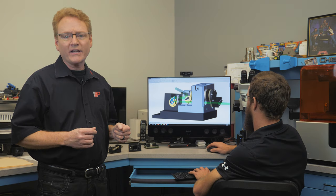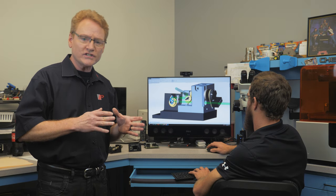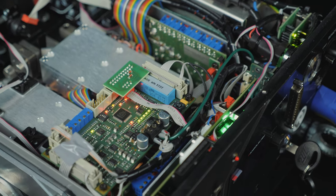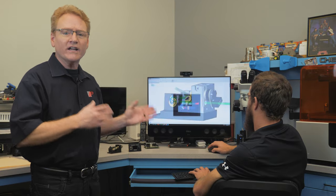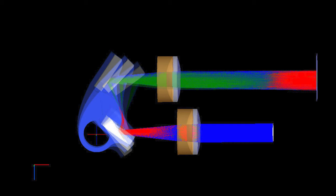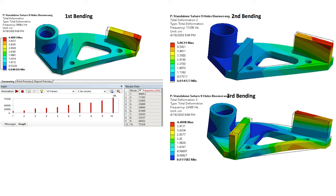For critical applications including audience scanning, the beam divergence can be monitored using the scanner's position sensor, which can be fed into PASS to provide an additional layer of safety. Now this may look like a simple system, but there were many technical challenges to overcome by way of detailed computer analysis. First, the boomerang needed to be made light enough to allow rapid motions, but also stiff enough to prevent the mirrors from resonating and flopping all over the place.